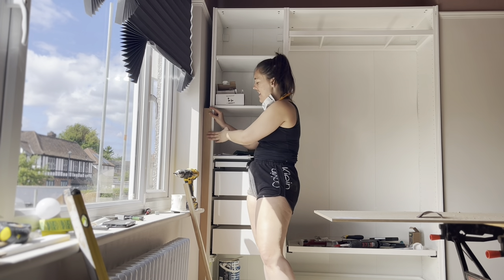All the doors are on, lined up and looking good. The inside is exactly how I wanted it to be and I've already started putting stuff in. Top tip: you'll end up with lots of holes in the panel — you can buy packets of little white caps that go in all these holes to make it look less like an IKEA PAX. The next step is to take all the doors off and prime and paint them the same colour as the wall. I also need a bit of MDF to go along the top to finish off the rim around the outside, then it's handle time.